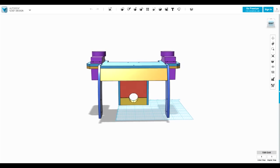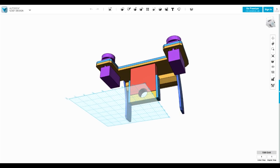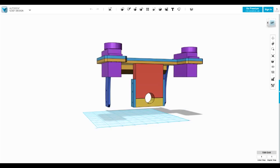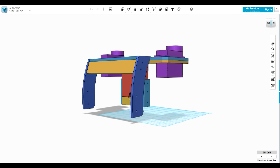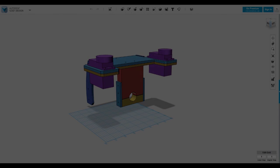So here's that assembly on its own. I've built the top plate there in 2 parts, so I can print them both flat on the bed. They're both 6mm thick, and then I can take out any warp by screwing those back to back. The other bits and pieces will screw on, and hopefully that should all fit in there fine.